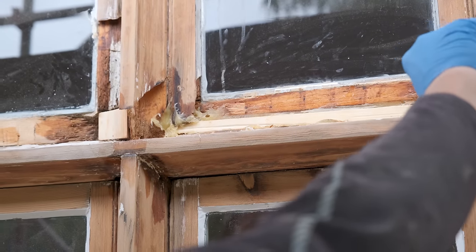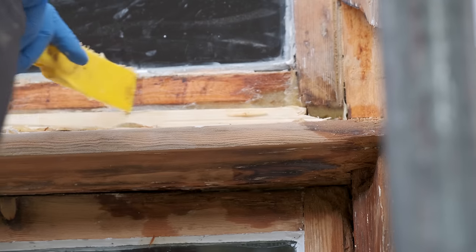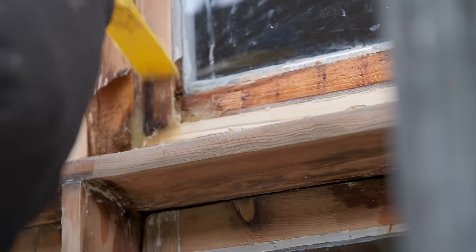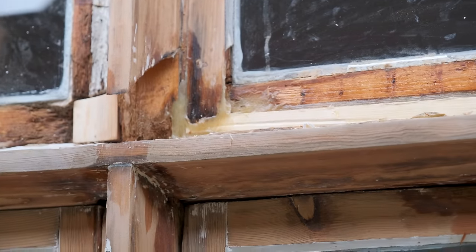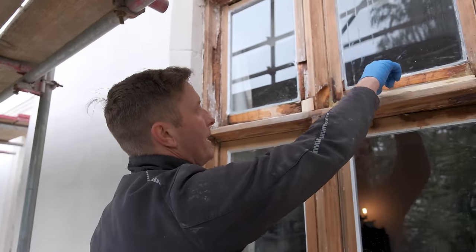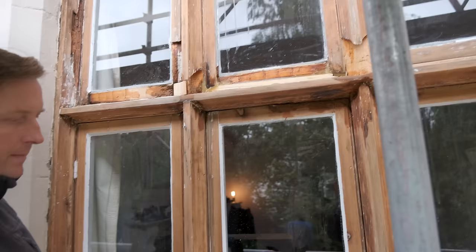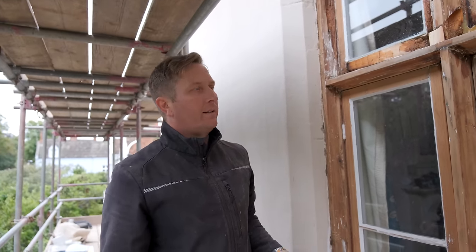Just by seeing that everything's squidging out, I can tell it's done what I need it to do — fill the voids. There's a bit of a void in there — I don't really like them on the bottom of things because water can sit in there if it ever got in. So we just keep squidging that in. So that's the first layer. I'm just going to make sure that the piece I'm putting on will clear that because we're a little bit proud in places — no dramas, I'm just planing a little bit off the back so it fits. That probably wants a small rebate on the bottom. So I'm just playing it in now and then I'll mix the next lot up and we can get that glued in.